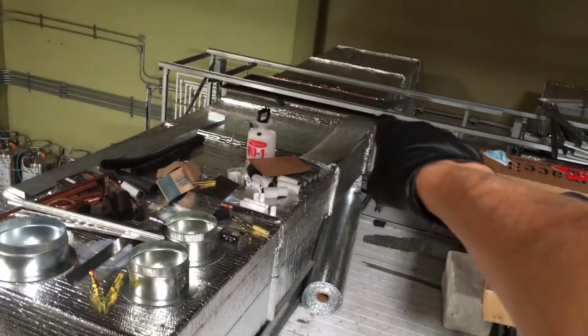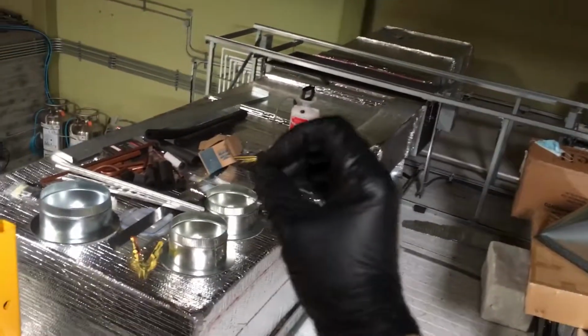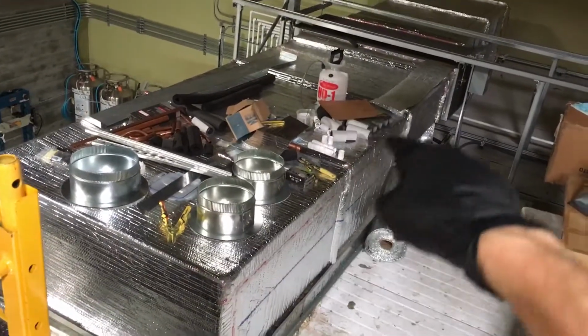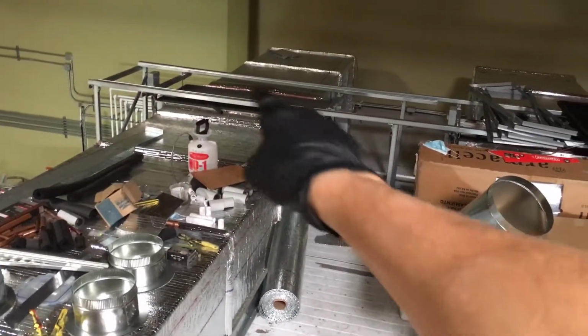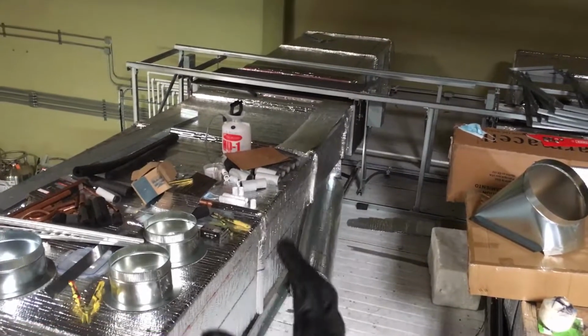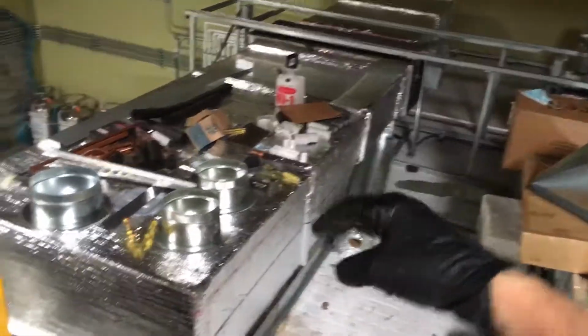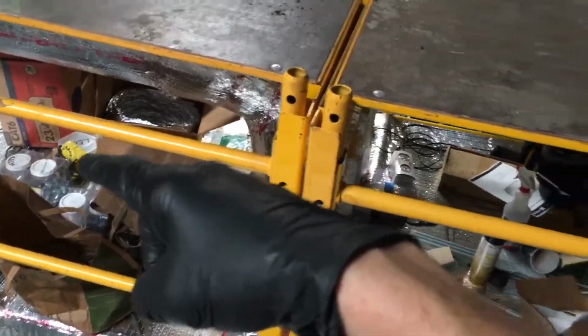We're going to have cold air feeding in and getting reheated or cooled off even more, depending on what the scenario is, but it'll be going through a HEPA filter and then feeding into the backside of our air handler right there, and it'll be on the side where the temperature sensor is not. And it's a really low volume. It's 1,000 CFM into this room, but it's going to be divided up into two. So 500 CFM is going to go into this air handler, 500 CFM is going to go into this air handler, or actually it's on the other side.